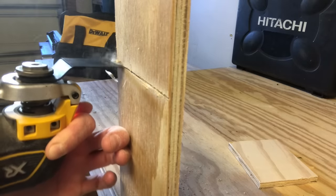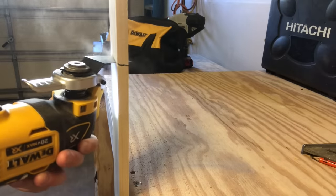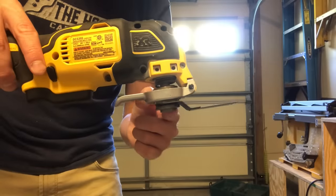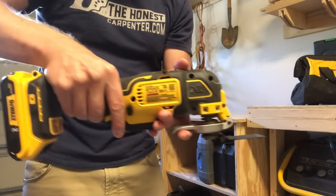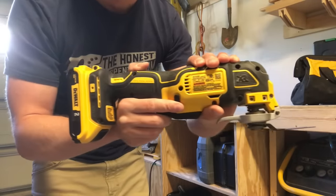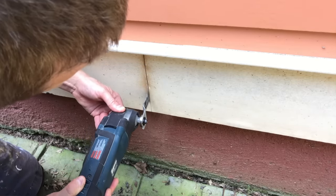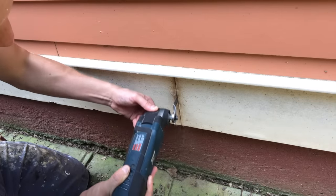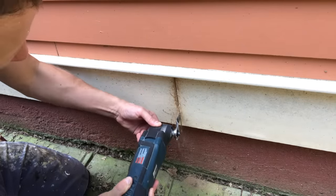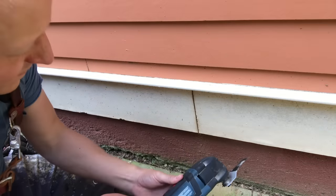The multi-tool lets you make plunge cuts with almost surgical precision. Because the blade simply vibrates, it creates a narrow cut path for which you can easily control your depth. Using the multi-tool is incredibly straightforward. You just load the blade so the bent neck angles downward. Then you can hold it either underhand, like a briefcase handle, or overhand, sort of like a telescope. Then carefully, with your knuckles, wrist, or elbows braced on a sturdy surface, you slowly etch a score line with the blade. Once you have that clean line established, you can start pressing the blade in with gentle side-to-side sweeping motions. The vibrations kick waste material out with each pass, and very quickly, you zip right through the hole cut.